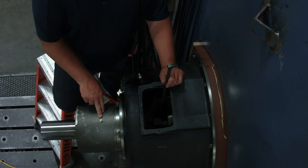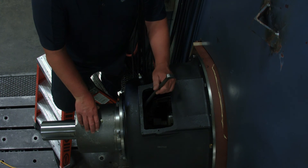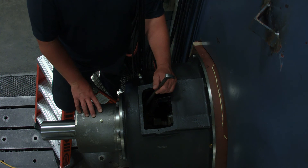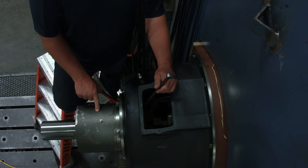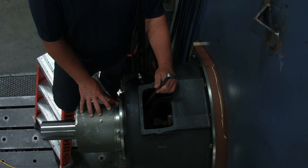Similarly, once a month it's always a good idea to purge the main bearings of grease — in other words, fill the chamber full. As you do that, look both on the inside and outside to see when grease starts to appear between the bearing carrier and the shaft. Once the bearings have been purged, or in a new installation, it is always a good idea to monitor bearing carrier temperature during the first few hours of operation, as we do not want to exceed 250 degrees on the bearing carriers, as bearing damage may result. As the grease warms up, some needs to escape between the shaft and the bearing carrier. Once it purges, the bearings will begin to run cooler again. It is imperative to watch bearing carrier temperature during startup and after purging the bearings.